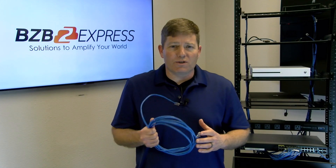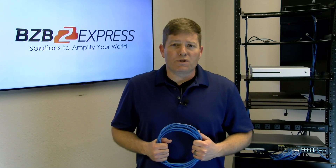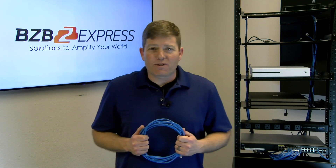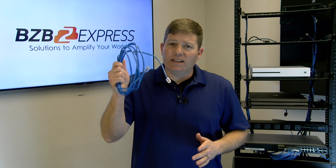You'd be surprised, but it's a lot easier and faster to drill quarter-inch holes in a new home project versus one-inch holes, saving time and money — especially when you've got over 100 holes to drill. Another benefit to category cable is it's less likely to fail over time. HDMI cables tend to just stop working over time. This guy won't unless you put a nail in it.